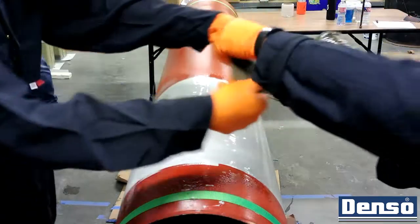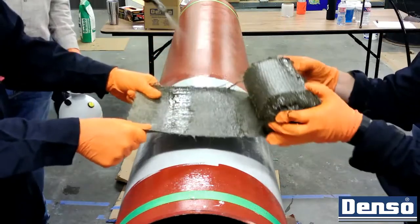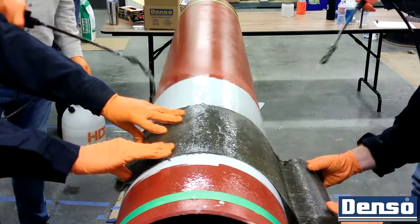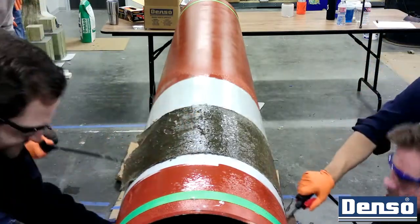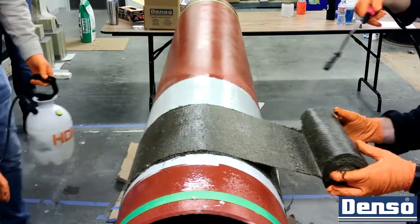As we call it, chop on top. The woven side of the fiber, which looks like a checkerboard, is to be placed facing the surface of the pipe. Wrap the material circumferentially to begin, ensuring that the leading edge has a minimum of two layers. Then proceed along the length of the pipe, wrapping with a minimum of 50% overlap. Ensure the wrap is completely saturated as it is being applied.